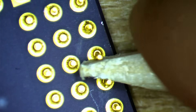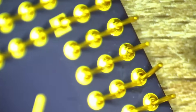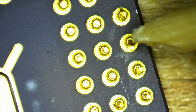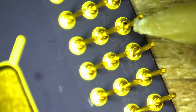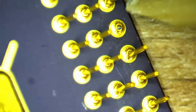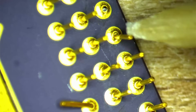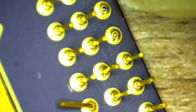The CPU is almost finished. The good news first: so far no pin has been lost during my work, so bending the pins back resulted in zero casualties, as many of you expected. However, two pins have been squeezed so much that their position is offset by a large enough margin that would prevent the CPU from fitting into the socket. With a heavy heart, I will deliberately remove those two pins and resolder them. I will not reuse the original pins because they are badly deformed at their bases — instead, another AMD CPU served as a donor to provide two shiny golden pins in pristine condition.